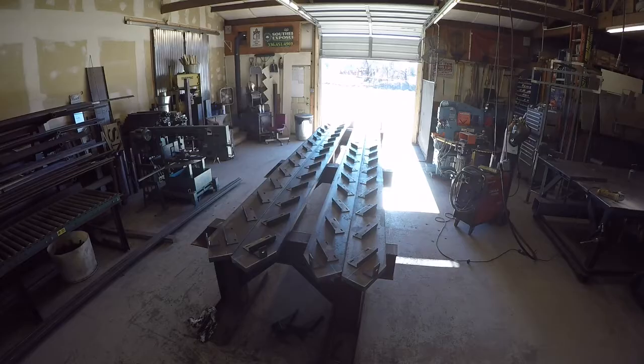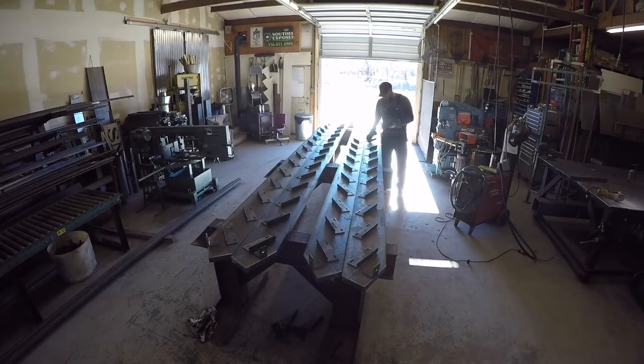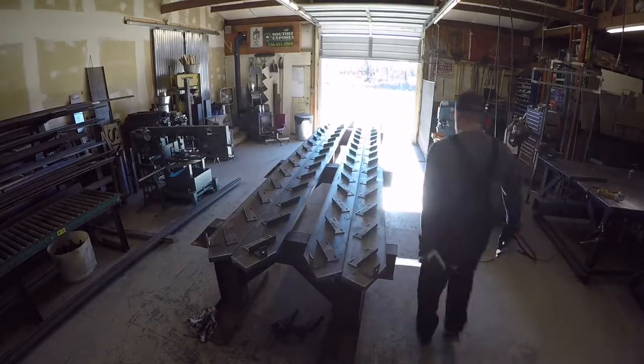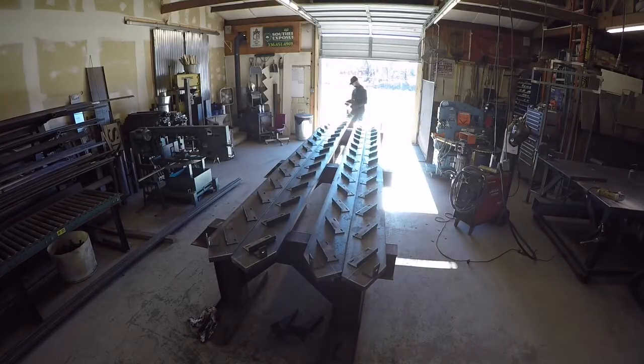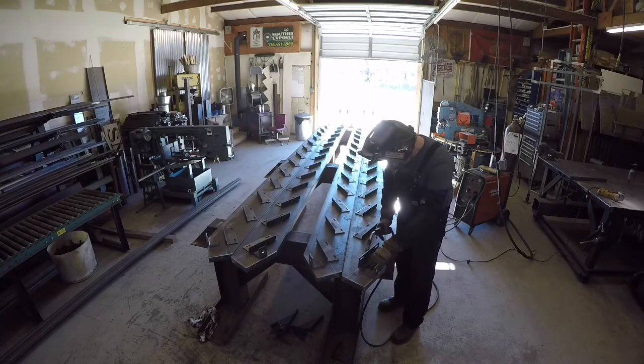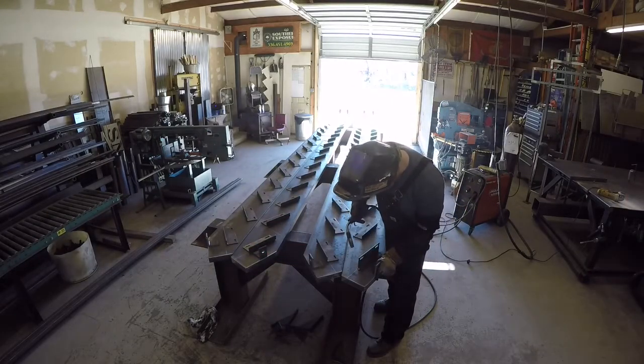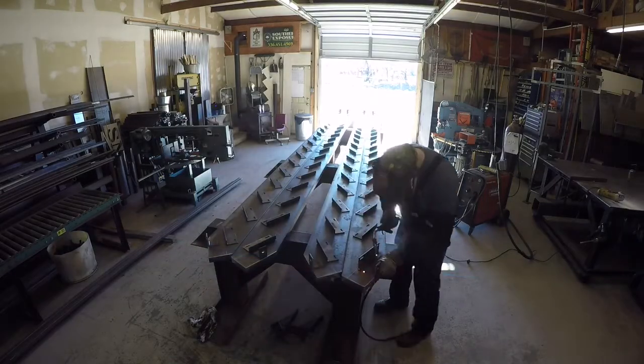You'll get to see some cool welding shots here in just a few minutes from a couple of different angles so you can see exactly what we do, then see the finished product. I always lay out everything first, get it all set in place, and then start tacking. Everything's laid out, and I'll start at the bottom end — just kind of my habit, the way I do it. I'll tack on the first clip at the bottom, which is the first step, doing the left and right as a set.